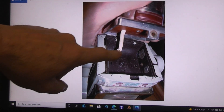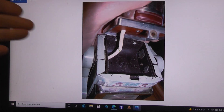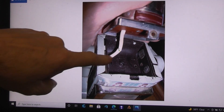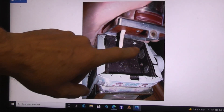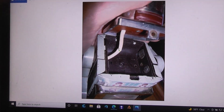The wires that originally ran up into the head, being from the 1960s — nearly 50 to 60 years old — had gone hard and cracked, so they had to be replaced with new wiring. You can also see the contacts in the battery box; they don't appear to have ever been plated, just raw steel, so they tend to corrode. Very unusual.